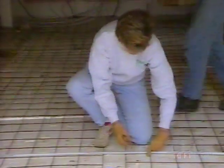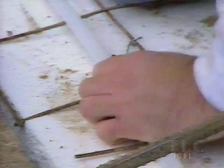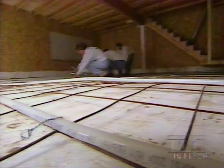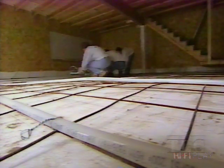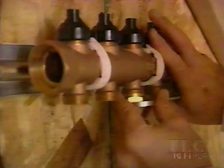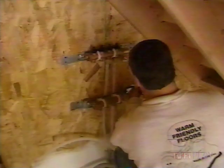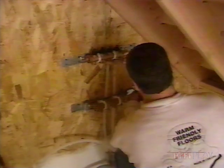Radiant floor heat offers several advantages in this kind of space. For one, the heat is evenly distributed through the space as opposed to space heaters. There's very little maintenance required on the system. The heat stays near the floor where it's needed instead of getting lost up in the ceiling. And of course, here in this northern climate, the heat will help the cars shed their snow and even start up in the coldest weather.